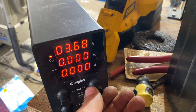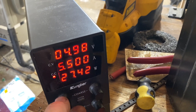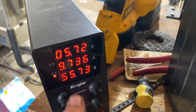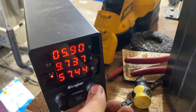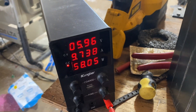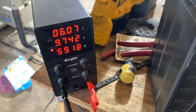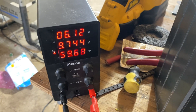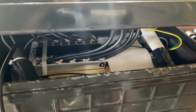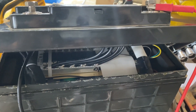There's definitely potential there, so let's keep it going. Let's even crank up the amps a little bit — we'll give it 10 amps, that'll be fine. Hopefully if we can get it up close to 10 or 11 volts, the BMS in here should turn back on again, and then we can charge it normally and let the BMS do all the things it's supposed to do.